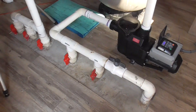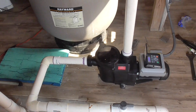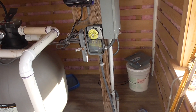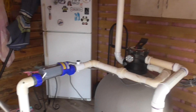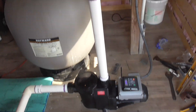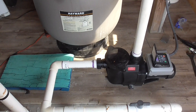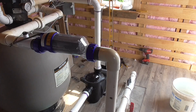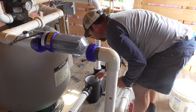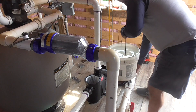The install is done. As I mentioned, the leading pipe going into the pump needs to be about a foot long — we followed the directions on that. I've set the clock and the power is on. The chlorine generator is off right now because there's no water in the system yet. Everything looks good. I'm hoping for no leaks — it looks nice and neat. I'm going to pour water in the pump to prime it, then turn it on and check for leaks. My pool guy always told me to prime the pump by putting water in it first.